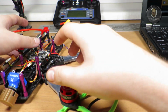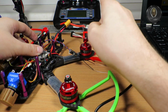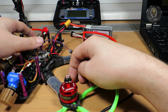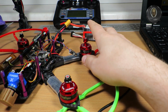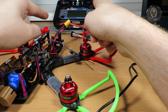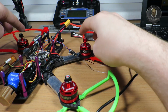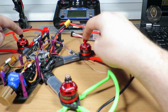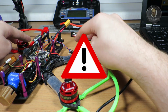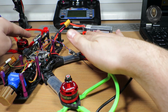Okay, so everything was working, but you need to disconnect the board and connect it again, and then Betaflight, or the board, is reading the RSSI. So now let me connect the power. The major thing to note: I did not put the propellers on the drone. That's why I can connect it to power. Remember, never connect the battery indoors when you have the propellers on.